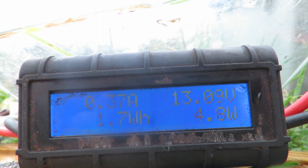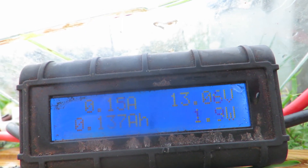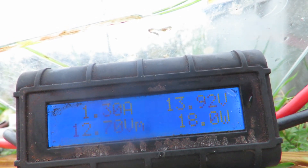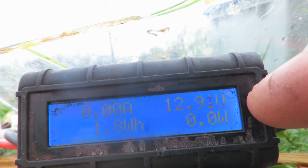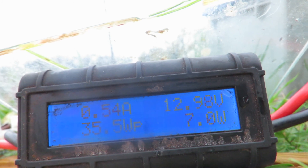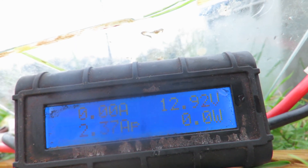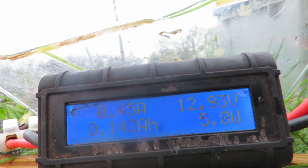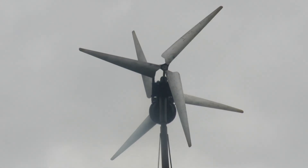It's been on for about an hour I'd say. Please remember the turbine is clearly constrained by the voltage of the battery — it's been stopping and starting. The peak was 2.37 amps. You can see it's done okay on the voltage of the battery; although it's not a great battery it will drop around to 12.6 volts, but the peak is 2.37 amps. 35 watts peak, 1.8 watt hours — woo! So now it's stopped and it's not making anything.